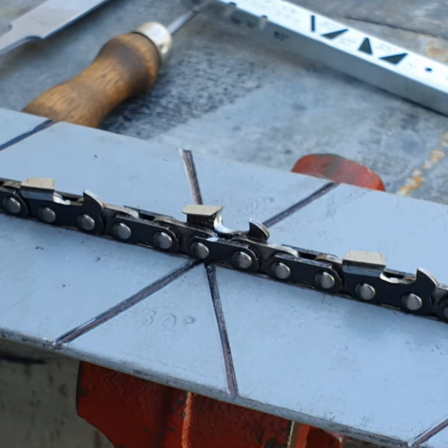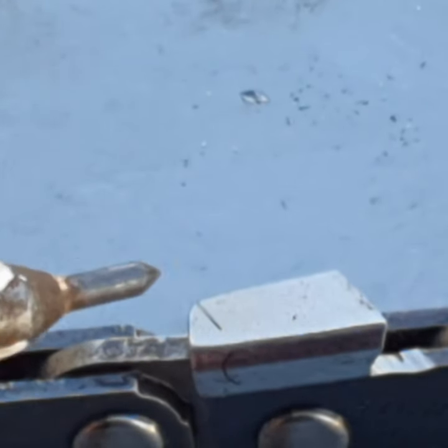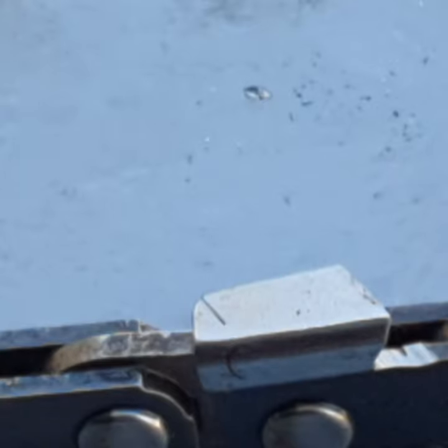The difference between a brand new chain and one nearing the end of its life — the actual tooth is nearly 10 millimeters long but there's a little witness mark. That small black mark means the tooth life runs from that point to that point, which is about nine millimeters — that's the life of the chain; after that you throw it away. Be careful: if you're cutting timber with a blunt chain and you put a lot of pressure on the chainsaw, the chain will stretch more, the bar will wear more, it'll heat up, and the sprocket will wear more. Everything is harder on the saw.